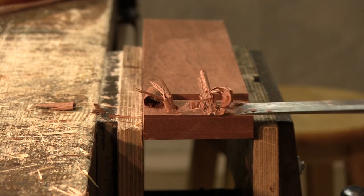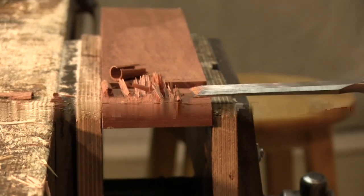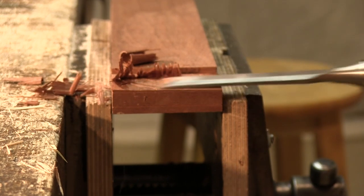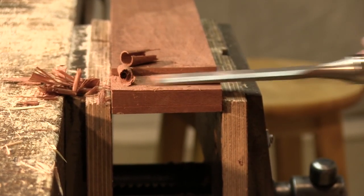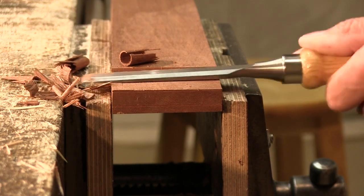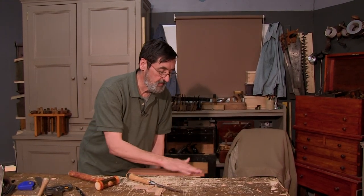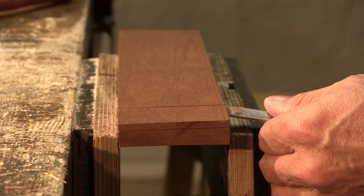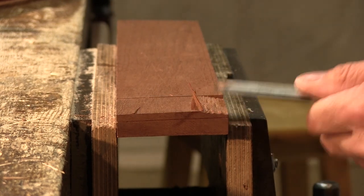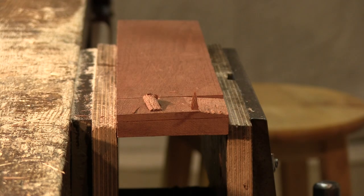There's the uneven surface — I can't get exactly what I wanted; there's a lot more resistance. Tons more resistance to the chisel. The double-handed method, gripping the chisel with short stabbing movements — when I get resistance, I just start over on one side and use half the chisel width and move across. If you have wiry grain, take the heel of your hand, go halfway down, one-eighth from the top, and pop it. If you're not used to this, go in with the chisel and hammer and go across.